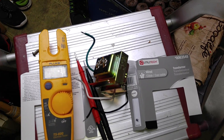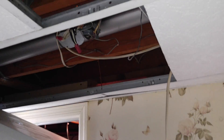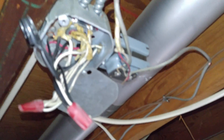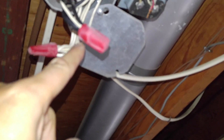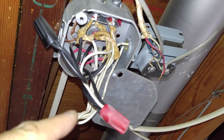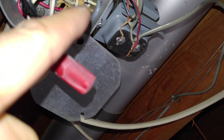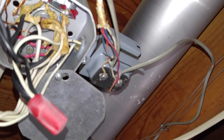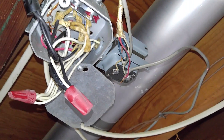I'm going to pan up now and you're going to see the raised ceiling. The fluorescent light is down so I could gain access to it, and right here you'll see I've already opened it up. This is what it looks like — this is our old transformer right here. You can see the two wires coming from it; it's pretty old, just has two white wires without the current black, white, and green designation. So it's going to be a simple job of taking this transformer out and swapping in the new one.